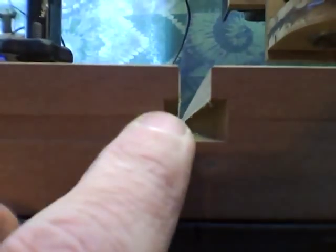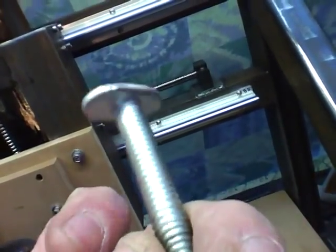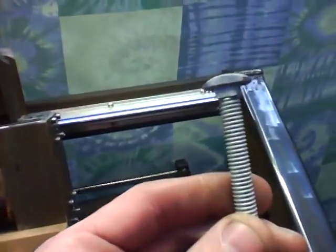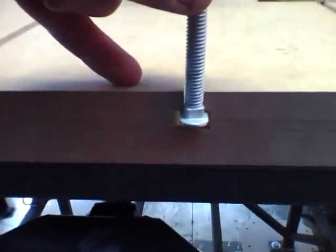I finished my table. These are my T-tracks that I milled in. I milled this part and then glued this part to the bottom half, and then after it was glued together I finished milling the smaller groove on top to complete the T-track. These are the fancy T-track bolts — you get these from Rockler Woodworking along with these really snazzy hold-downs. I needed more of these and didn't want to wait a week or spend the money, so I got some carriage bolts, cut the heads off, and they seem to work just great. The little square bit at the bottom fits these tracks just about right — it's a little tight, but pretty darn close.